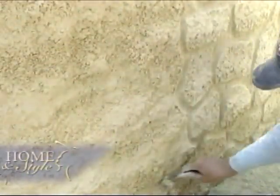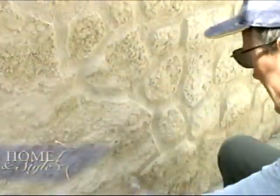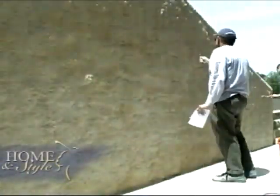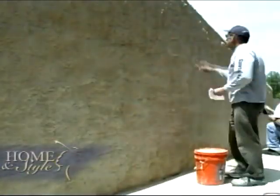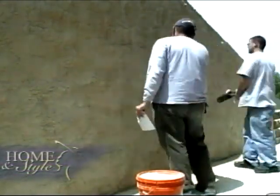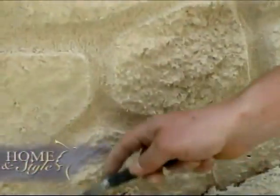What I do is I usually have a picture of what the client wanted from the picture book, and we are going to try to replicate that look on that wall that they wanted. So it's just a matter of following that picture book. You use a carving tool that gives you the grout line, and then once you've got the grout line you start going back over it with a brush to smooth it out so it looks like a normal regular grout line that you've actually put mortar in and put a stone in place on it. As you can see, this is not for do-it-yourselfers.